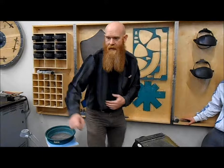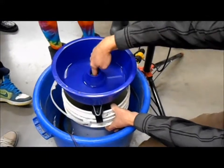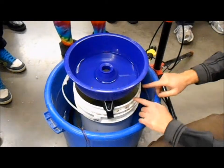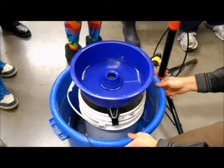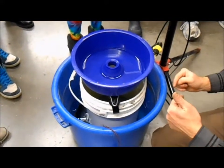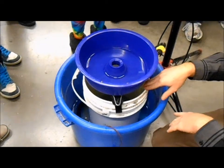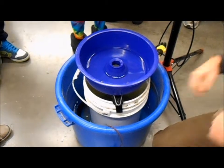On the blue bowl we have a bucket underneath — all the material falls out the center, the sand goes down into the bucket and settles to the bottom, the water builds up and flows over the top edge into the bigger bin where the water pump picks it up. With the blue bowl there's not nearly as much or as violent water movement, so the sand all settles out and almost nothing ever gets into the bigger bin.